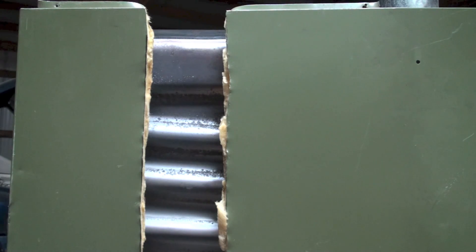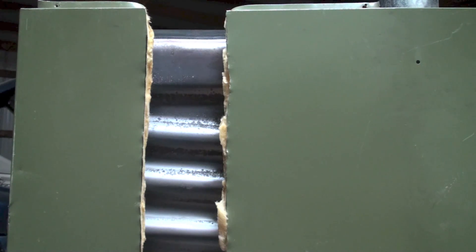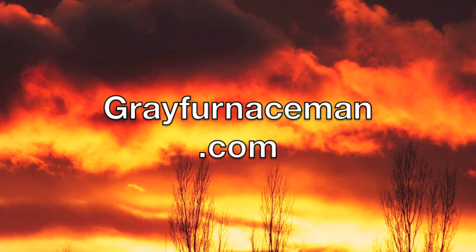This is by far not the most efficient heat exchanger out there. This was built before they had the requirements for efficiency - it was called the 80% furnace, not a highly efficient furnace. That just gives you an idea of how the heat goes through these. Remember, we're checking the outside of the heat exchanger, so we're really not checking what the gas temperatures are inside. I'm going to do another one on these a little later with a higher efficiency furnace and we'll see what happens there.